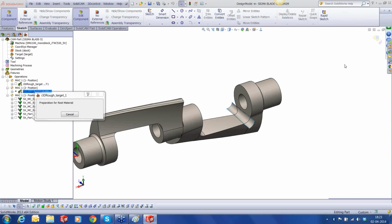Okay, oops, sorry. My mistake. I need to put 250 millimeters as an offset from the Z0 to the center of rotation, and now we can run the machine simulation. No wonder we're getting some errors in the Y-axis and B-axis also.